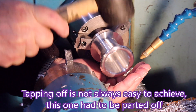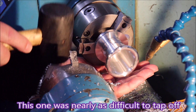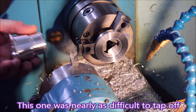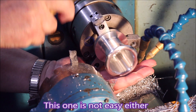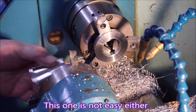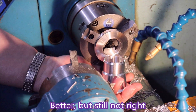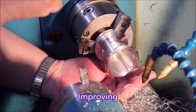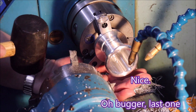If you hang around a bit you'll see me trying to get the part to not drop off. The thing is, if you don't remove enough material, when you're hitting it you can actually pull it out of the jaws — which means you can't really part the thing off anyway. I'm adjusting the tool in X to go in a little bit further each time, but it just took a while to get it right. They're starting to come off a little better — a couple of sharp wraps and it's off.